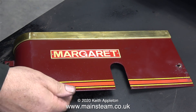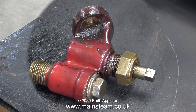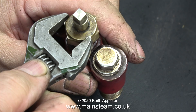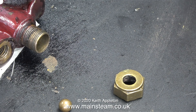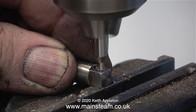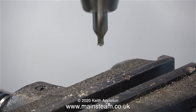When I made these motion guards I wanted them to be removable easily and quickly, and in no time at all here is the check valve on the bench. I'm going to dismantle it to have a look inside. First I undid this large gland nut to stop any leaks from the valve. It's packed with graphite yarn, which has been in there a long time because it's quite hard. Apart from the tap, inside the other chamber of the valve is a large bronze ball. One problem I had was I didn't know which way was on and which way was off, and when I first got the traction engine the valves were set only halfway open.